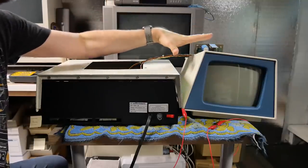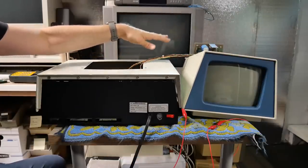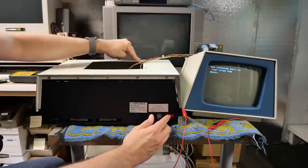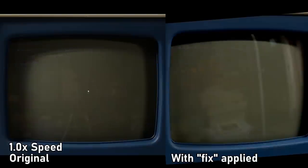The analog board is all connected to the PET — power and video signal come through the top. Let's turn it on for the first time. We have an image. And now for the moment of truth: when I turn it off, will we get the spot? We still get the spot. Clearly the spot fix didn't actually fix the spot, at least on my PET. That doesn't mean Frank's spot fix is bad — it actually did work for him. But there's something else going on on my PET, so I'm going to dig into that in the next video.